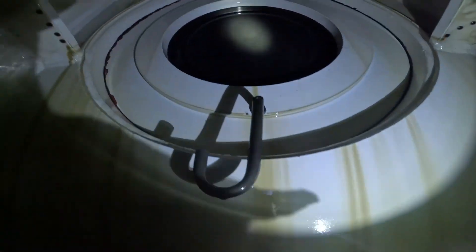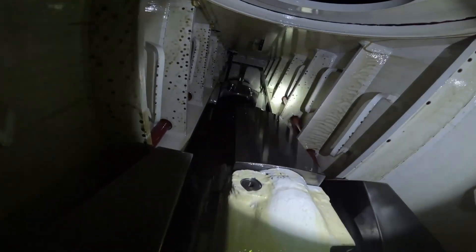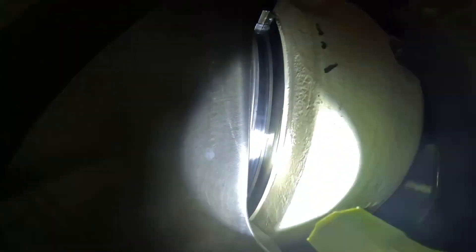We are on the other side. Okay, here is a relief valve — to relieve the pressure. Now as I said we are in the crankcase. On the top you can see the crosshead stuffing box from the end. You can see the sliders, right shoes, in front of me is the connecting rod and the bearing.